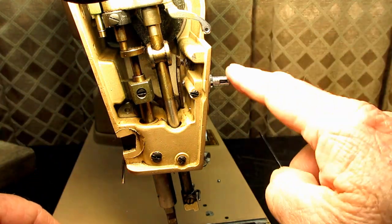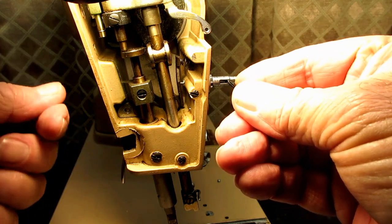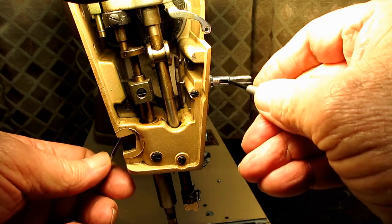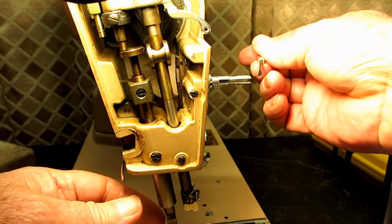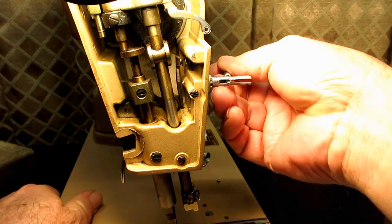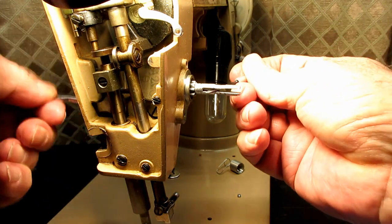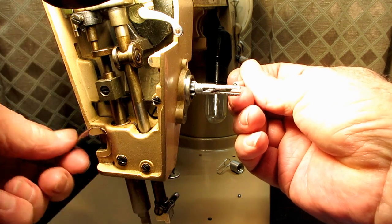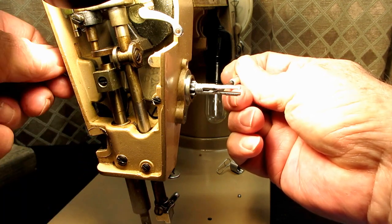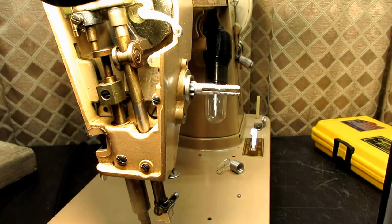To see if you've got the tension pin all the way in, you can put your screwdriver in there and lift this, and you should feel your screwdriver getting pushed away. That pin is pushing — I can feel it. It only moves about that eighth of an inch or less, but you can tell that you've done it properly.